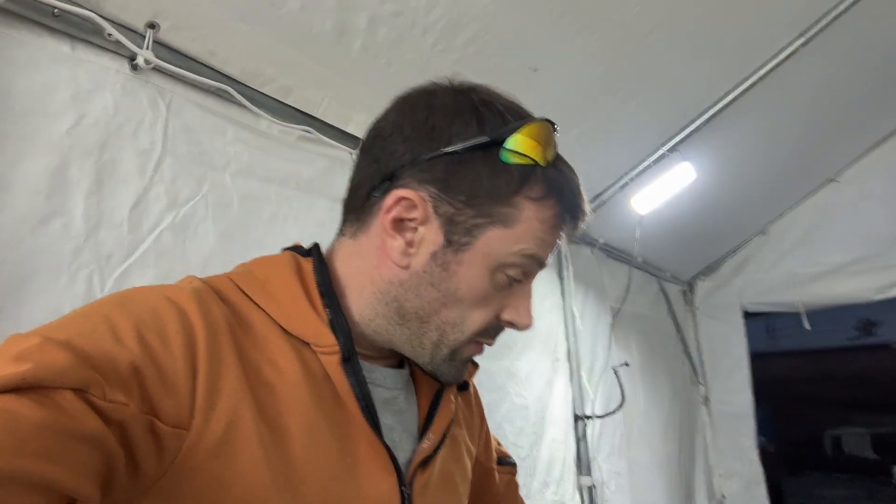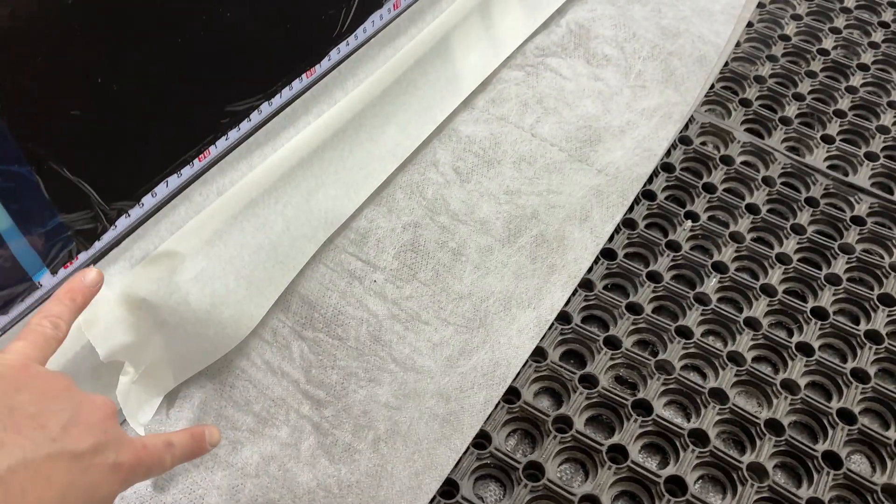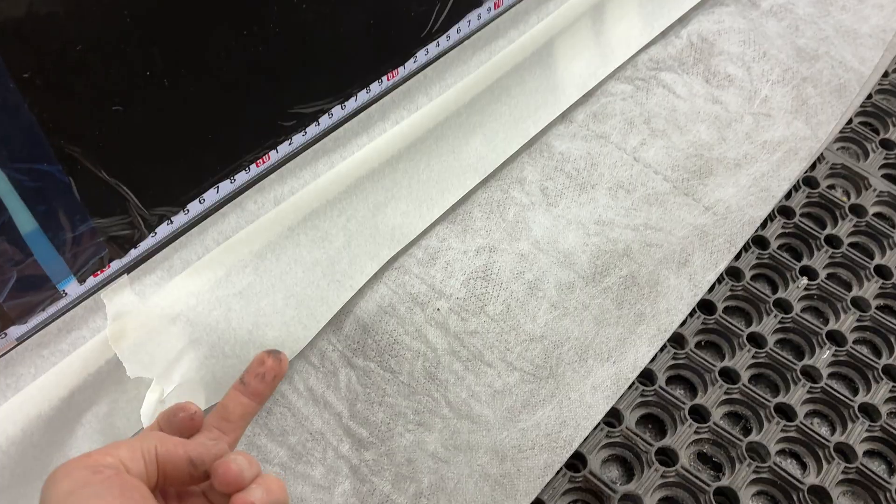We have some lights set up so we'll be able to work past sunset, because the idea of doing this in late summer is unfortunately not really working out for us right now. So we've done the gum tape, done all the perimeter, and the two of us have finished off by putting this extremely wide strip of low-tack masking tape all the way along and around, only affixed at the top and just flapping at the bottom. That means that any drips of resin that might come down the sides of the mould during the lamination — which is kind of inevitable, even with quite viscous resin at relatively low temperatures in the teens — won't drip down onto the gum tape, which could ruin the seal. That would be a complete disaster. So that's a protective layer that will come off just before we put down the vacuum bag and press around the edge to form the seal and pull the vacuum down.